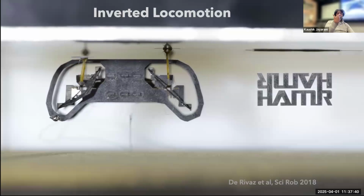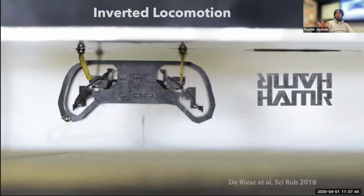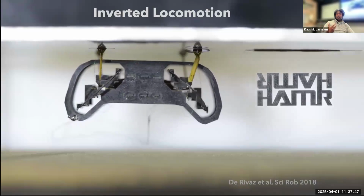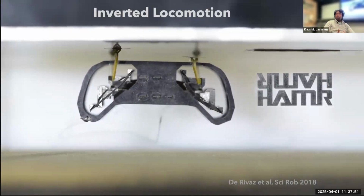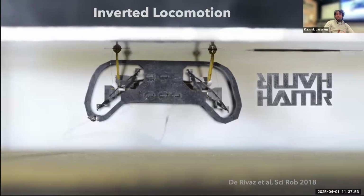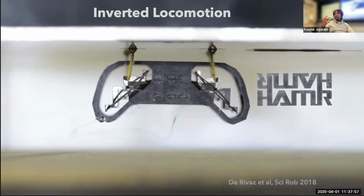A common theme you will see in my work is that because we're building small-scale systems, we are constrained in some ways because they're small. They have limited size, weight, power, all of those things. But at the same time, you also have some advantages because they're small. They're really light, which means that with things like electroadhesion, you're still applying high voltage, on the order of 200 volts to a kilovolt, to get this 1.5 gram robot to stick to a surface.